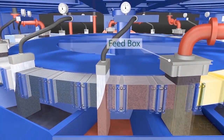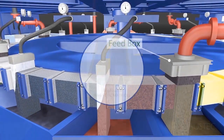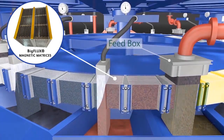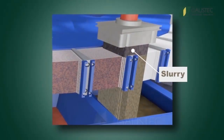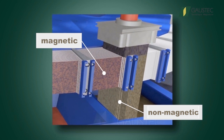As can be seen, while the rotor turns clockwise it inserts a clean matrix in front of the magnetic pole, which becomes immediately magnetized by induction. The slurry flowing from the feed box passes through the matrix grooves and is split up into magnetic and non-magnetic products.